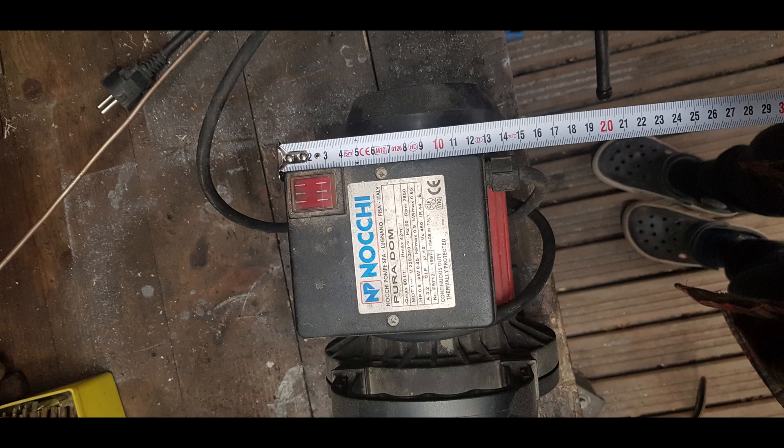During my research for this project I looked at a lot of small mills and drill presses. I found that they typically have motors with 500 to 750 watts and around 1500 rpm. The spindle speeds of the commercial machines were between 100 to 2000 rpm. Obviously I need to get my spindle speeds within the same range.